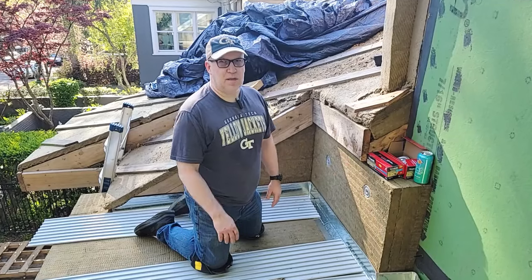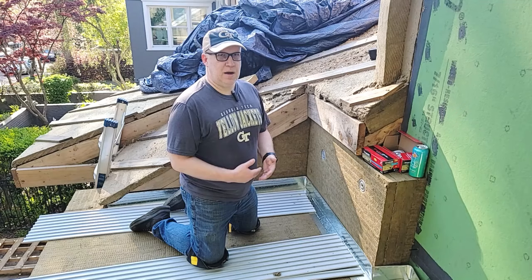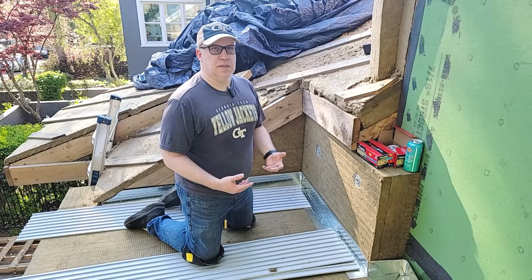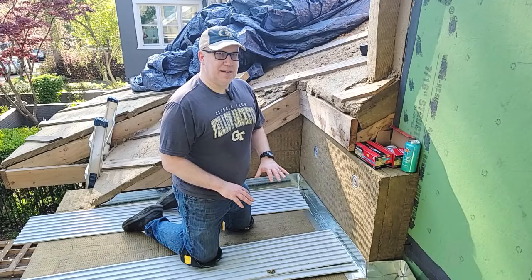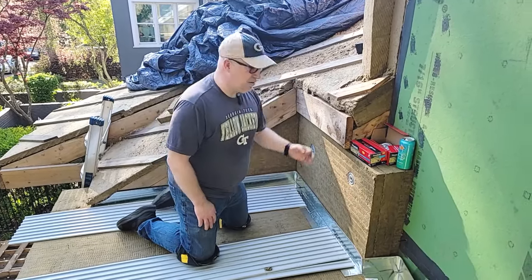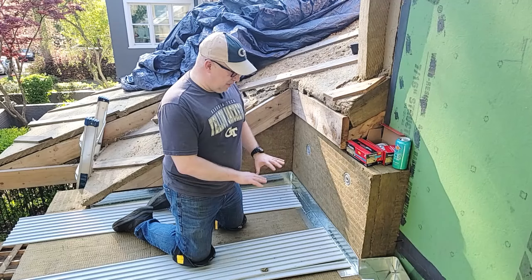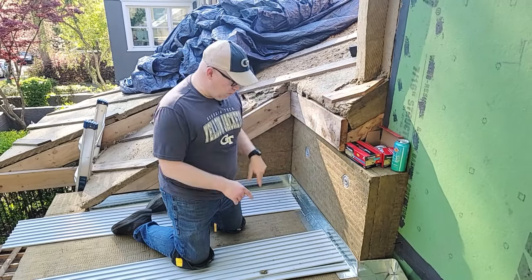Again this is eight inches. We've got the Comfort Board 80 Top Rock here and put some flashing around the edge as a starting piece. The instructions didn't call for that, however when I pour the cement I'm going to put a grout base down first — 3,000 PSI — and I didn't want it to go over too far. This is also going to allow us to put the furring strips down on top of that because I want the flashing behind the furring strips. Furring strips go down, we're going to put the bug screen on the bottom. So this kind of sets up the wall assembly so we can transition cleanly to the roof.